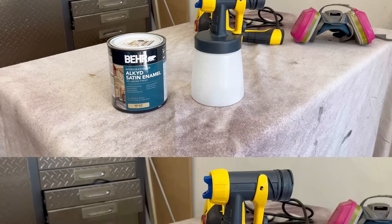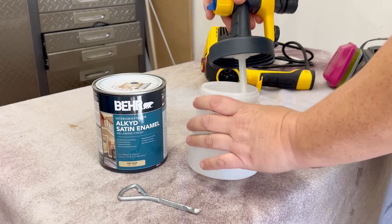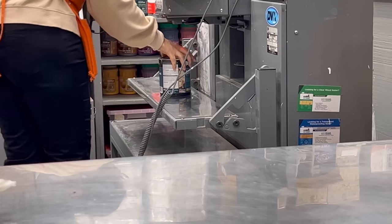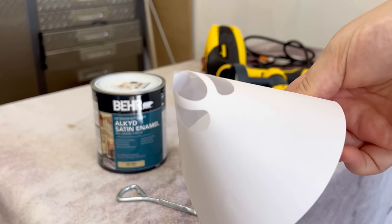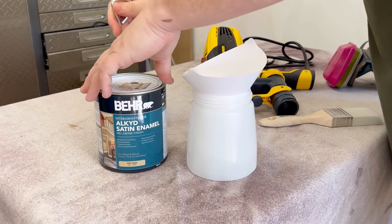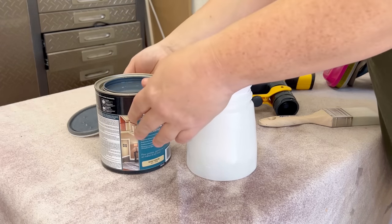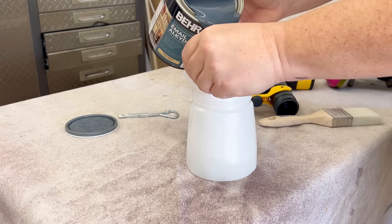I'm using some paint right from Home Depot today. You'll see a lot of specialty boutique-style furniture paints on my channel and I do love them all, but this paint from Home Depot can be tinted to whatever color you want and you're not limited to a specific color palette. It also comes in a few different sheens, and this particular paint is formulated specifically for furniture and cabinetry, so it cures up to a really hard, durable finish and doesn't need any additional top coat. I had a quart mixed up in the color Midnight Blue — a really pretty dark, smoky blue.